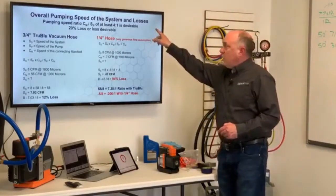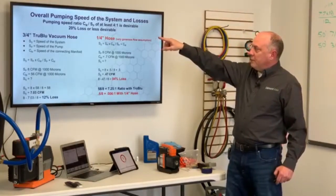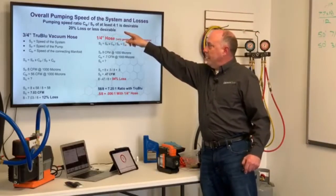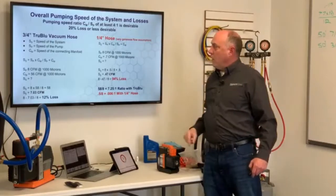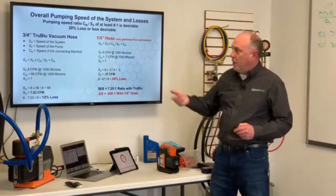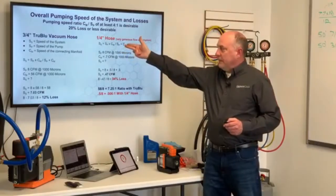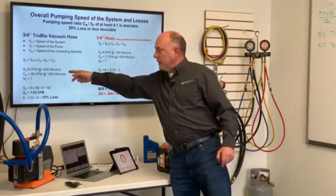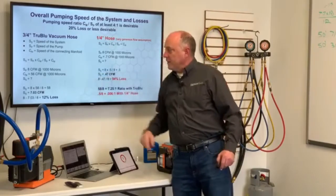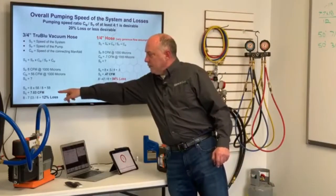But what we do have to talk about is overall pumping speed and system losses. And again, going back to vacuum for service engineers, they want a conductance speed of the manifold versus that of the pump to be 4:1. All right. So what I've got here is just simply SS is speed of the system, SP is speed of the pump, CM is conducting speed of the manifold, and there's a formula there, right? And it's basically saying that if we had an 8 CFM pump at 1,000 microns, and we connected our true blue hose to it that's got a conductance speed of 56 CFM at 1,000 microns, the overall system conductance would be 7.03.